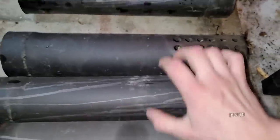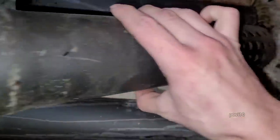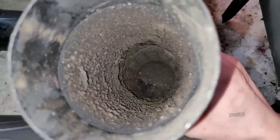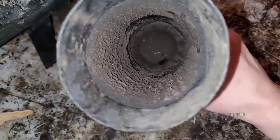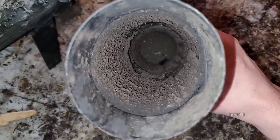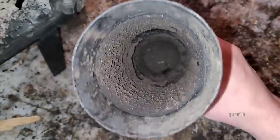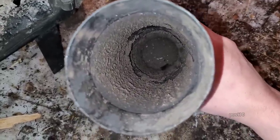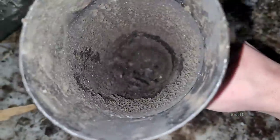Let's take a look at it. This is the pipe up top — it looks like it definitely helped clean those holes. And just like it said in the instructions, look at the inside — it compromised the creosote so it all just bangs off. It did work! After all that, look at that — you bang it and all the creosote has now kind of hardened and is flicking off. Basically that makes it burn really hot so it should all just eventually fall off. Now it said to see full effects of the log it may take up to two weeks of burning.